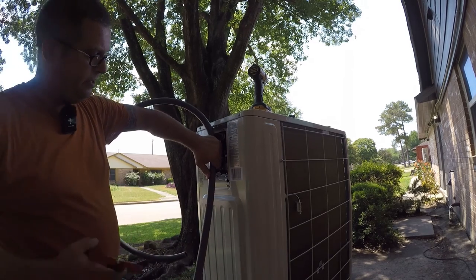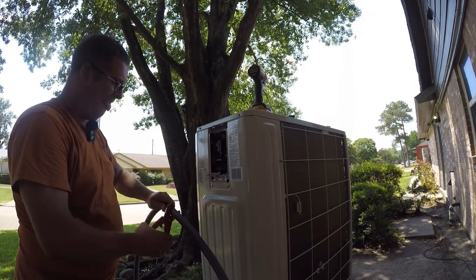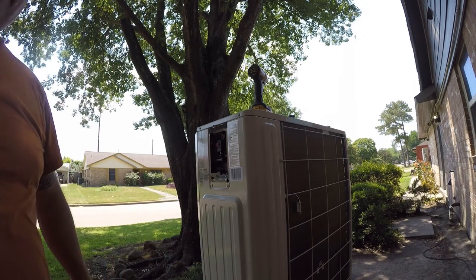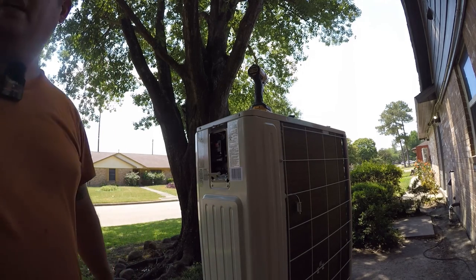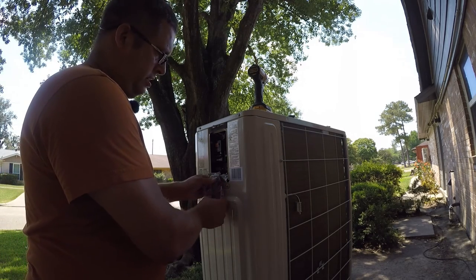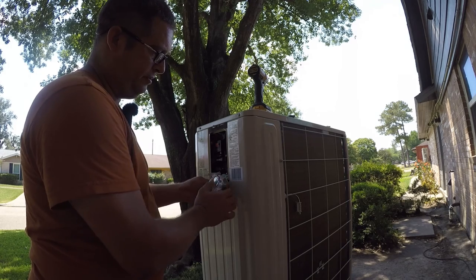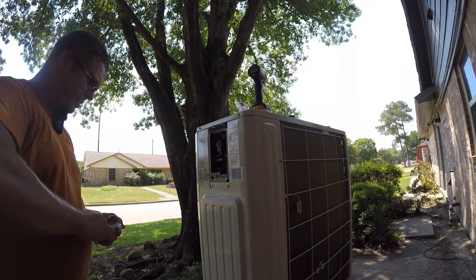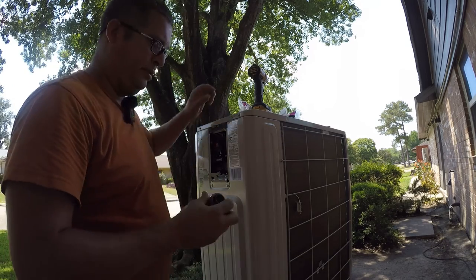So we'll take a pair of tubing cutters and just slice right through it. That's the beauty of the non-metallic stuff, in addition to it never rusts. Now, a 90 isn't gonna fit here. It would fit this way, but that's not right. We need a drip loop. So we're gonna use another straight connector, and we'll return the other one.